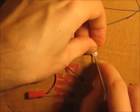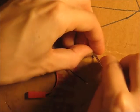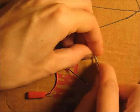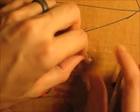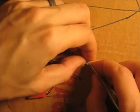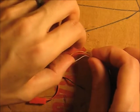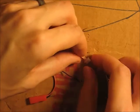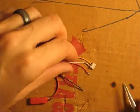Now let's take out the red one. More important than trying to push the metal out is getting the white plastic part to pop up — it kind of has to happen at the same time. So pop up and push. Until a little bit of metal comes out the end, it should be loose. I don't want to pull very hard — just wiggling gently, and there it came out.